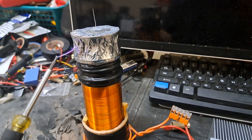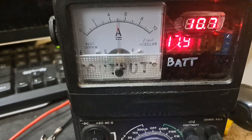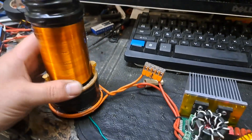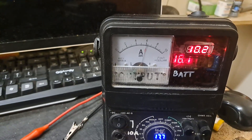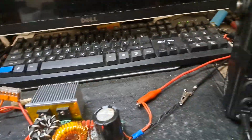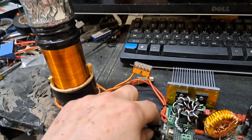So with this kind of tuning, I get real fat arcs at the higher voltages. But basically as I'm pulling the arc out the top load, I can load it down a little bit further. So let's move the coupling real far back — quite a bit looser coupling — turn it back on again. And in continuous wave it goes up quite a bit, but then as I pull the arcs, it's pulling the current down. You can sort of adjust how that operates with the coupling. Then I'm moving it back down, right about there — fairly close, a little looser than normal Tesla coils.